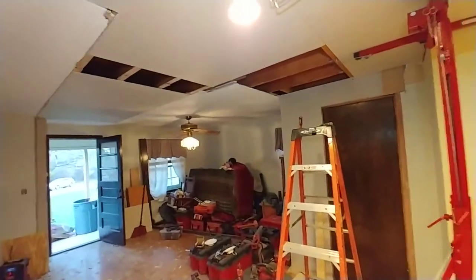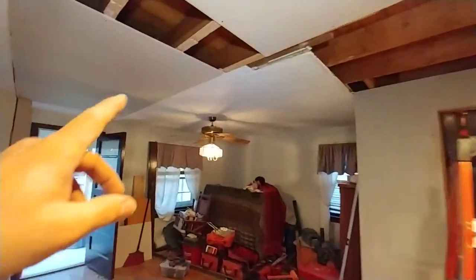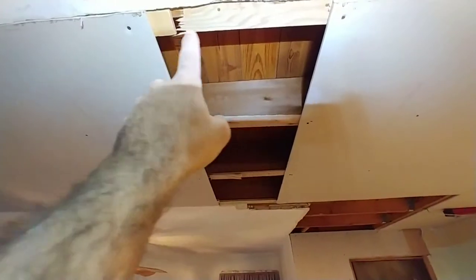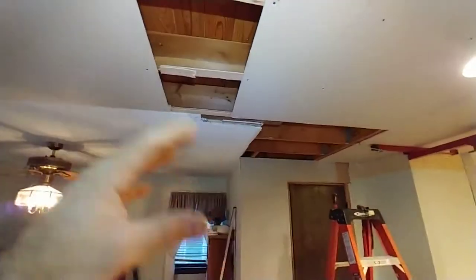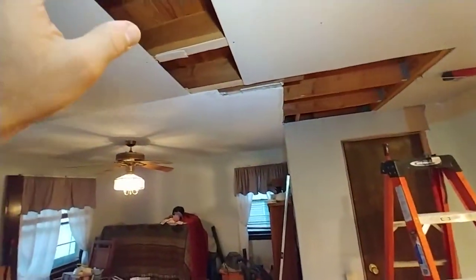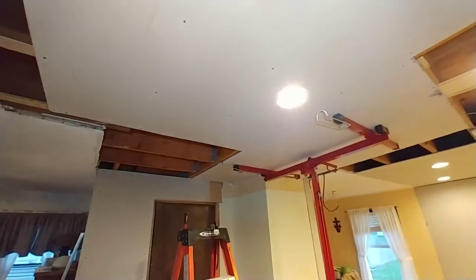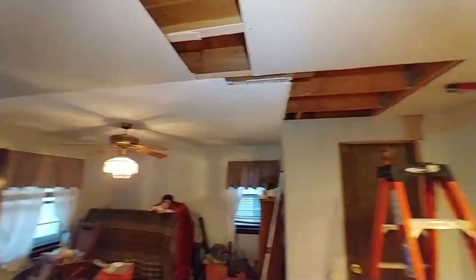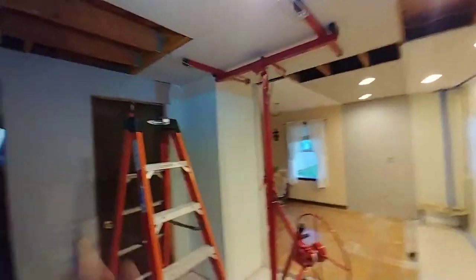We're down tight to the framing here all along, but this is sort of the art project — when I get into areas like this, it's going to be a tough spot. I carried a half inch across there, then went to two layers of quarter here, to one layer of quarter here, and two layers of quarter here to one layer there, and just a half to one quarter here. This piece will basically be twisted in, and he's a small piece, so ideally you'd come through here with a nice long piece over a transition like that, but I just didn't know exactly what I wanted.